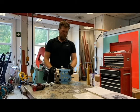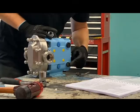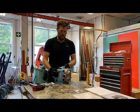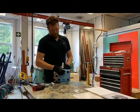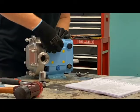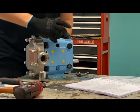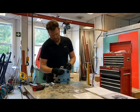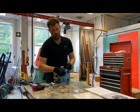The most common maintenance with these units is changing the oil, greasing the bearings, and it is absolutely critical that every time the gear case or the bearings are greased that extra grease is removed from the chamber in between the bearings.